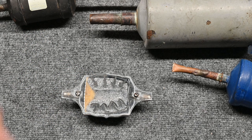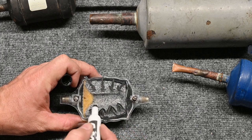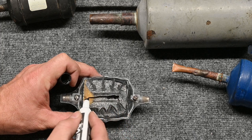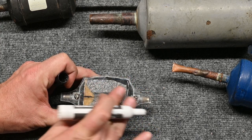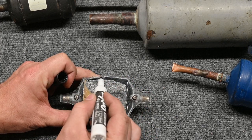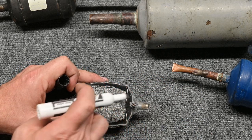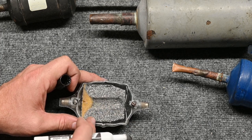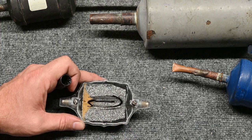Think about this like those little packages you get when you order a product — the little packages absorb moisture and keep that product nice and dry. The same thing is happening here. So this is filtering from the outside, then it collects together on the inside of this tube, goes through the filter material, and on to our liquid line. On surface area alone, there's a lot of surface area around the whole entire perimeter of this filter dryer, so it can collect a lot of contaminants on the outside. As the refrigerant gets closer and closer to the center, it's purer and cleaner.